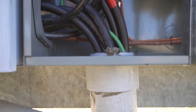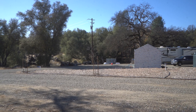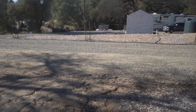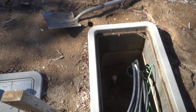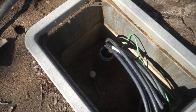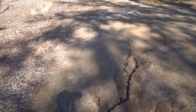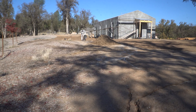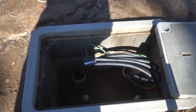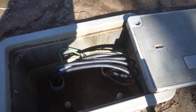Let's follow that conduit and see where it goes on its way back to the house. We're not quite back to the house yet, but one interesting note is how the wires get there — we were all the way back there by the service entrance. The wires come underground about 160 feet through into this pull box, which is a concrete box you can use when you have a long conduit run. They all pop out of that conduit and go into another conduit that extends up another 120 feet into the house — almost 280 feet of wire total. When you have that far to go, making turns is difficult, which is the purpose of this pull box. Also, I said six wires earlier — there are actually seven because of that green ground wire, which we'll come back to in a minute.